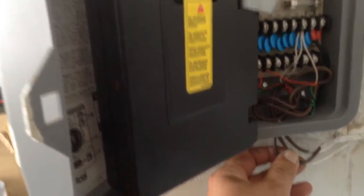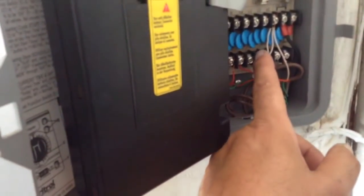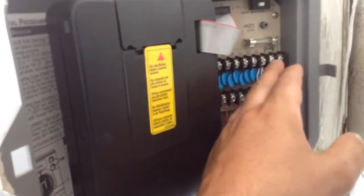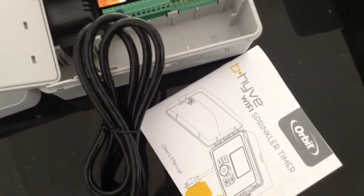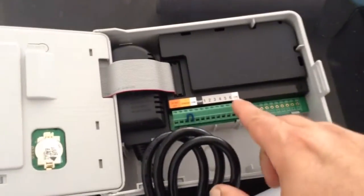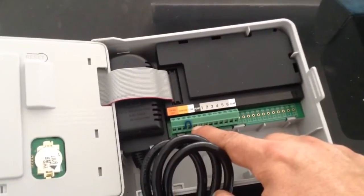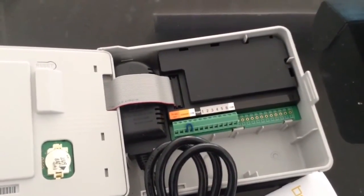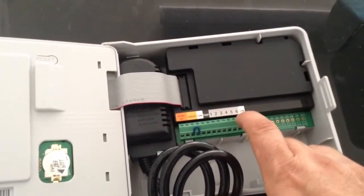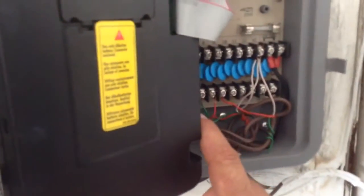We have pre-wired sprinkler controllers. It wasn't immediately clear which was positive or negative, but the VC — voltage common — wire is what we're calling the negative. These all go to the same thing. The instructions aren't very detailed, but they want one end of each wire into a common terminal, which only looks made for one wire. So I'm going to split them — we've got four zones: two wires over here, two over there, then four colored connections for the zones.